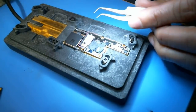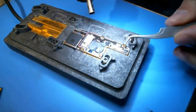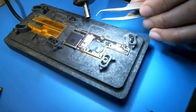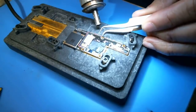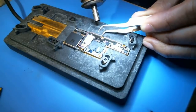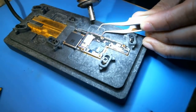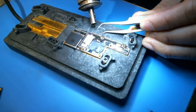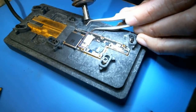Nothing. I'm just going to add a little bit of heat like I did earlier. Last time I kind of jacked up this chip right here, so I think I'm going to do it near the Wi-Fi chip, or maybe towards the middle. I'm going to hold my tip a little bit further than I normally hold it and see if I can get my tweezer in between there. I'll put it a little bit closer as we go.